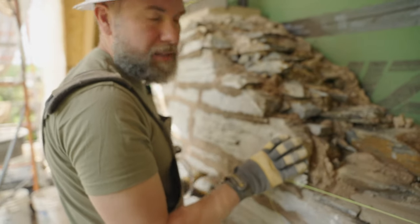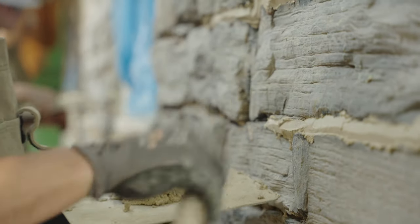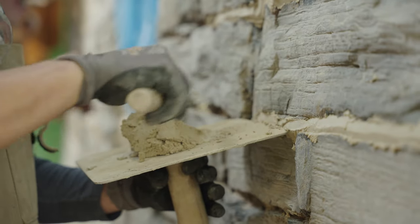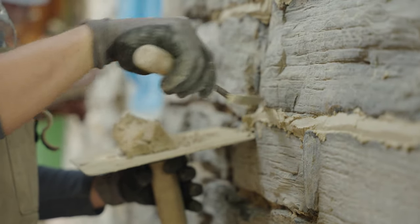Really the strength comes from the way the stonework is laid. On the outside we want a lime mortar joint with a higher lime content that we would point this up with, and that lime mortar actually seals the moisture from coming through the wall and rinsing out the mud bedding mortar.